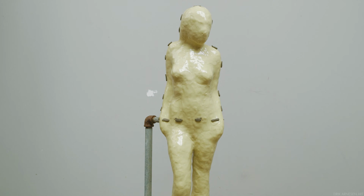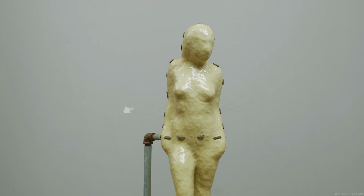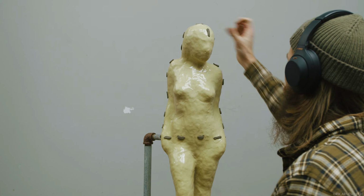Silicone is flexible, so I'm really only limited here by the mother mold. But unlike the silicone, the mother mold can easily be made out of several smaller pieces bolted together. So instead of having two halves, I can have one half with two pieces of mother mold. So in this scenario, I make the decision to keep my silicone wall where I originally wanted it and to separate the upper front half of the mother mold into two pieces.